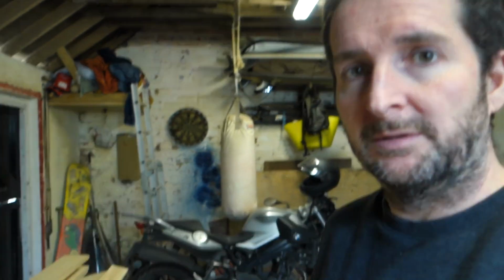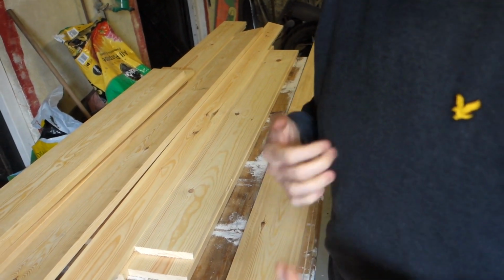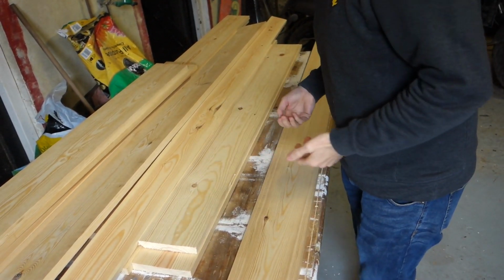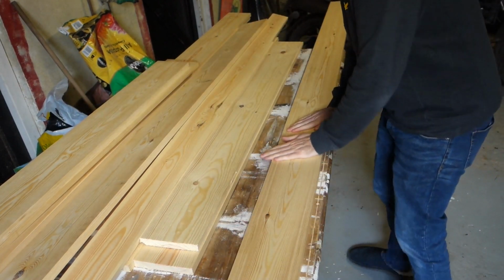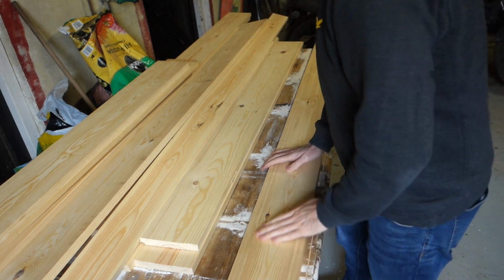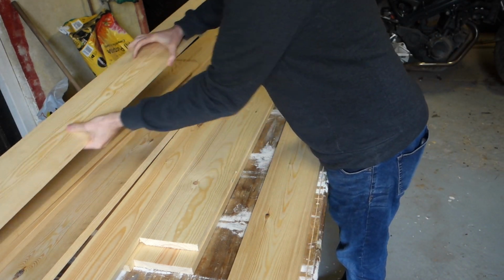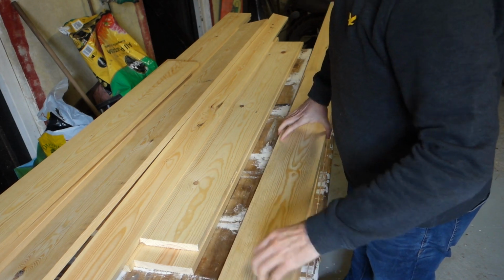I'm going to start by jointing some boards. So I'm going to be using some PAR. I want the width of it to be about 600, so 4 6-foot ones, about 150, so that'd be about 600 in depth. So I'm going to choose four of the best that I've got, and now I start cutting them and putting together. So I've already chosen them. I've found four pieces which have virtually no knots.